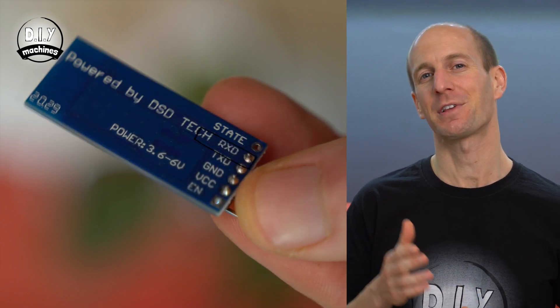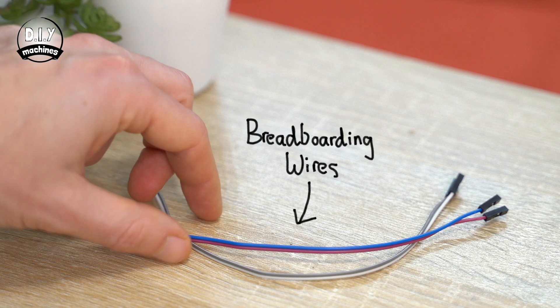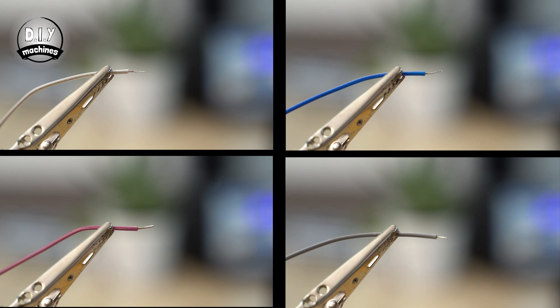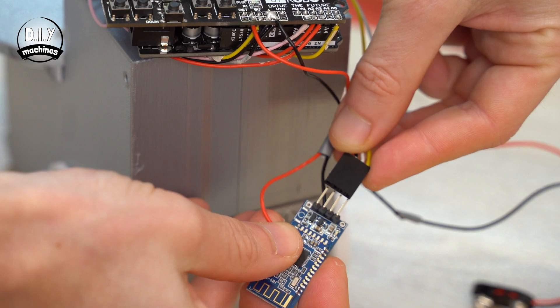We're going to be using all four pins on this HM10 module — that's the receiving, transmitting, ground and VCC. The VCC will provide it power using the 3.3 volts from our Arduino Uno. If you're not going to crimp your own connectors, that's no problem. You can just trim some female breadboard jumper leads to the required lengths, strip them, and then tin the other end so that you can solder it to the display later. If you don't have any jumper wires you are willing to sacrifice, you can consider soldering directly to the module.